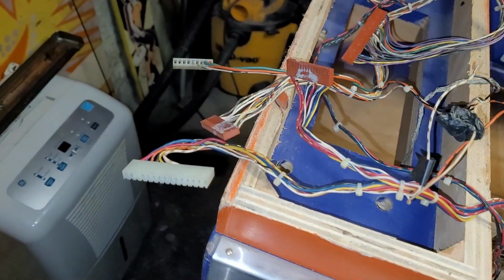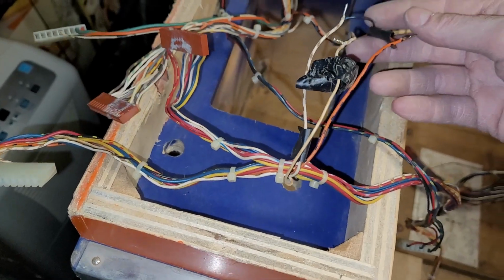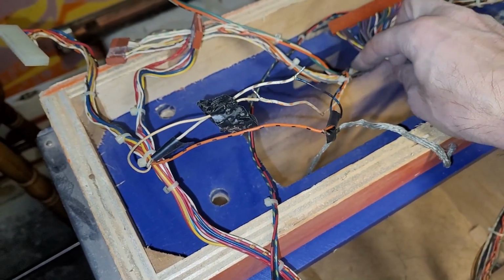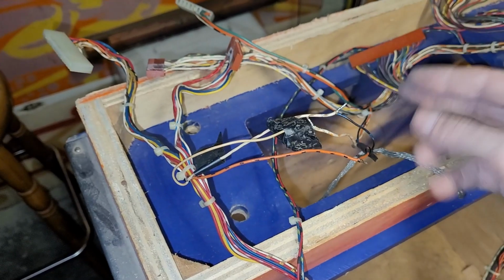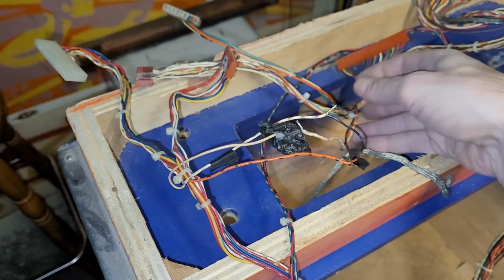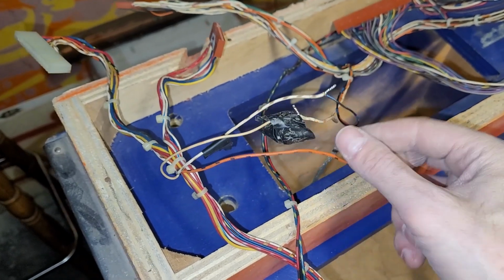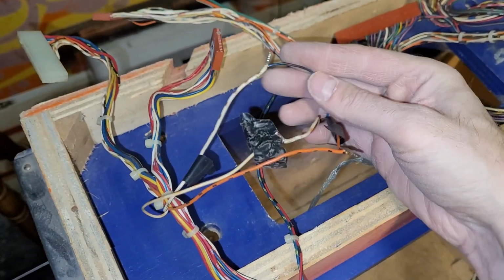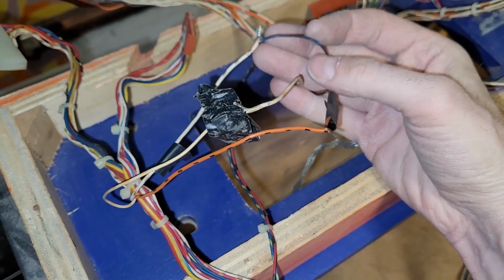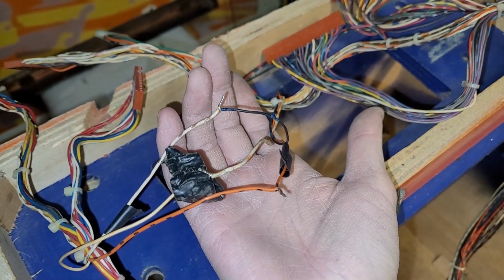And then I took a look over at the wiring harness, and it's not as bad as I thought. As a matter of fact, the only thing I see is these weird 3 wires that come from this harness get tied into 3 wires from this harness. And I'm almost wondering if that's factory, because why would anyone do that? I guess we got orange, black, and orange, black on this side, white, orange, and white, orange on this side. And this is the only one that is a little bit off, well, a lot off. White, brown versus black, blue. So this is so very random, it makes me think that it's possibly factory.